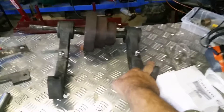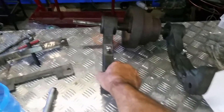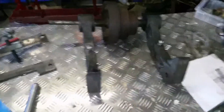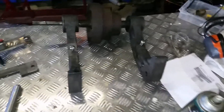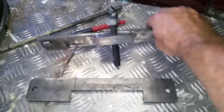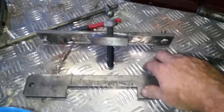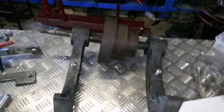This is what came with it — these are the drive pulleys and brackets. They're independent and self-aligning to a degree, so just putting them through a rod isn't enough. They twist when you apply any sort of belt pressure. So I've machined a couple of flats in there, tapped it on both sides, and these thick brackets bolt to it and keep it rigid so it doesn't twist when you tighten up the belts. The thing's been chewed up a bit but it's still fine — it's for the drive pulleys.